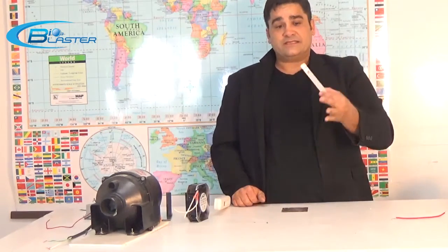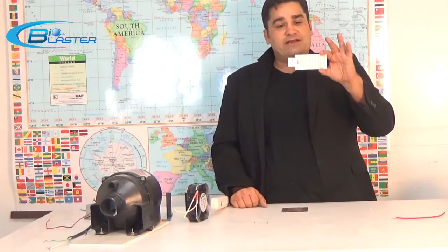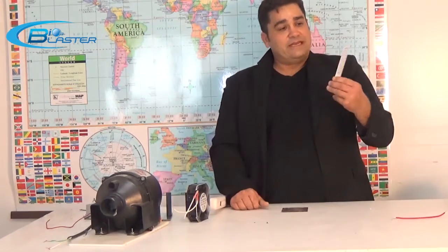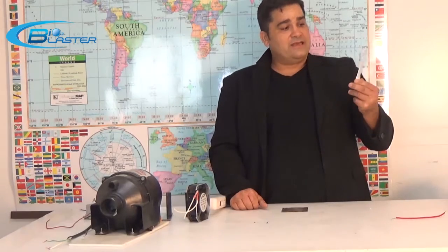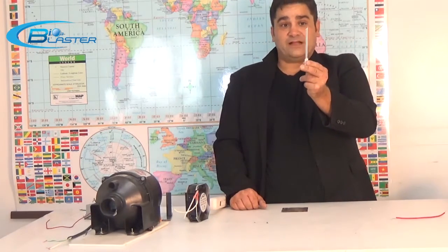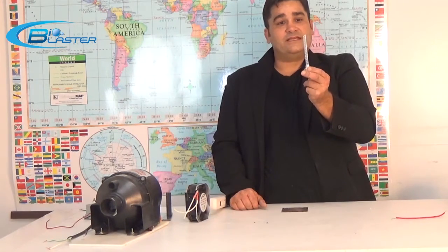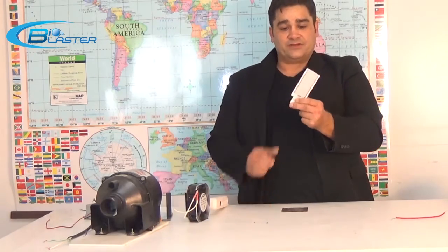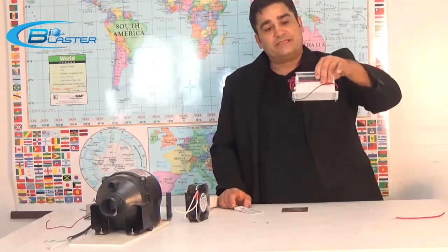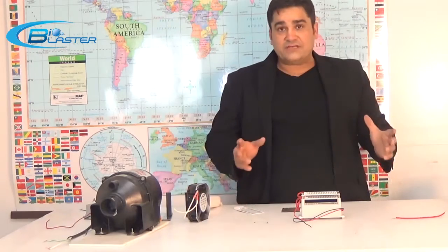Today we use the very best high-quality plate material on the planet. We have finally succeeded in finding a way to make a high-quality tungsten plate, which has the highest burn-through rate. I don't source these from China — most ozone transformers and generator cells come from China, but this particular model does not. This is a 10,000-hour rated plate. Rather than using a simple foil on the backside, we have two generating cell areas utilizing high-quality tungsten and hospital-grade ceramic as the dielectric. In some models we use double-stacked versions, which allow us to get a lot of ozone into a tight space.